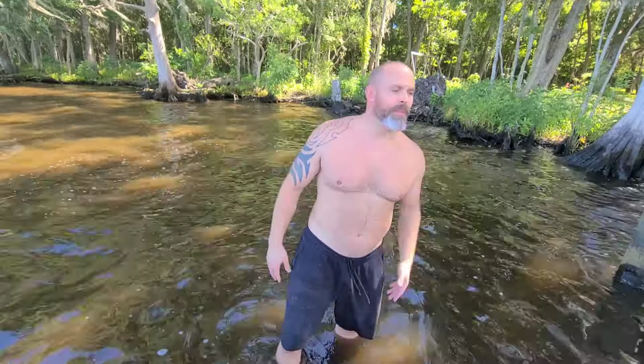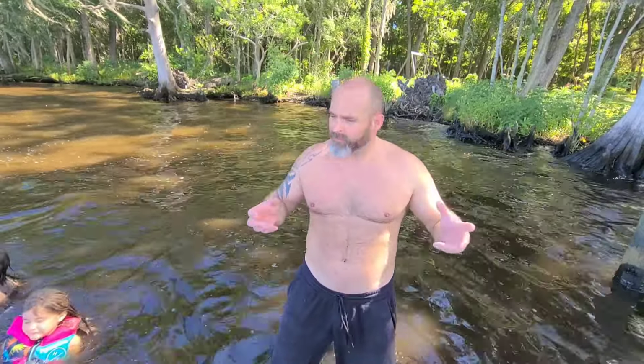You can't get on your horse and ride. It goes, and then when you try to get up on plane, you can hear the prop cavitating, and you just don't go anywhere. So that's not good. Hopefully it's just the splines and the prop starting to wear down, and it's not the shaft spinning around the prop without it gripping and ripping.